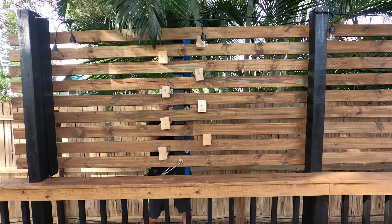Once this is accomplished and everything is squared up, make sure your support post in the middle is spaced correctly left to right, then tap in a couple of screws in every board and you'll be good to go. It's not necessary to put in two screws in every one in the middle since it won't cup as much there as on the ends, but you can if you want. Then just repeat this process for the center panel or the other panels as you move down.